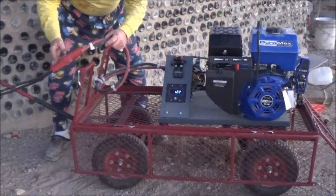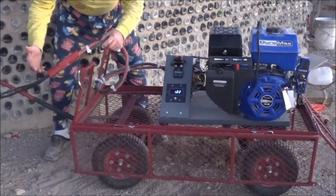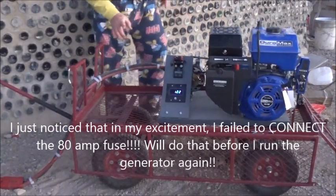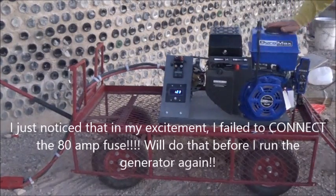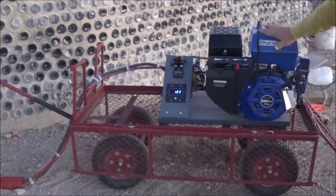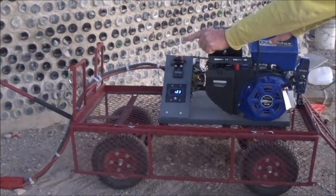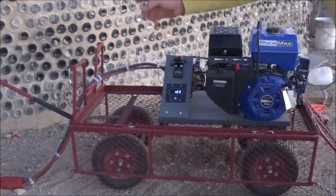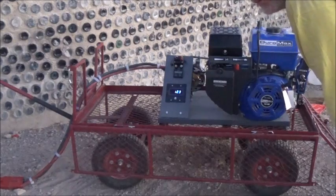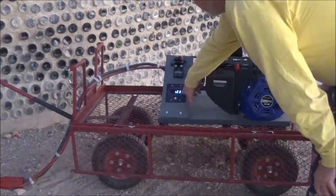Coming off the back of the PMA is four-ought wire. I've got the plugs here — normal forklift plugs. The four-ought wire comes off and goes in, but unfortunately I had run one-ought wire all the way out, so it goes from four-ought to one-ought — I can't help that, but I think the one-ought will be okay. The whole thing could start by wiring into the house's 12-volt system, but I used my motorcycle battery, which makes this truly portable. Right now it's plugged into the emergency plug — the one we use when we pull the truck up to charge the battery bank in a dire emergency. Hopefully this does away with the emergency.